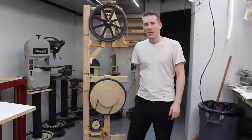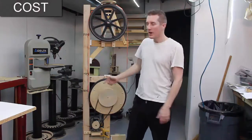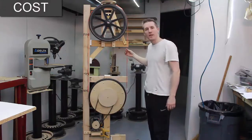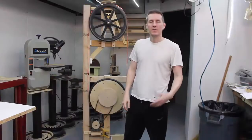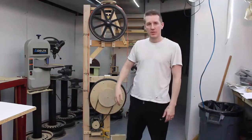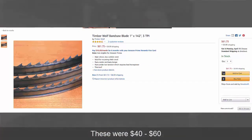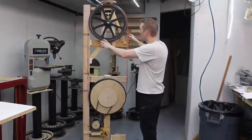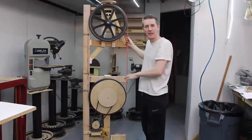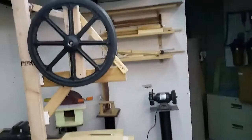If you can make your own relatively cheaply, I'm planning on not spending more than $100. Right now I've spent $25 on a blade — it's actually a meat cutting blade, the cheapest one on Amazon. A couple of reviews said it's just as good as some Grizzly $50 blades. It was about $15 with $8 shipping. I needed to know what size blade to buy, so when I mocked this up I measured with a rope and figured it's a 138-inch blade. Things like that I'm answering before I make the final version.